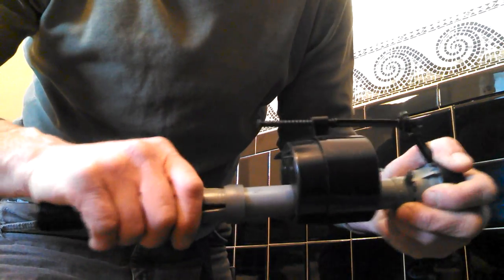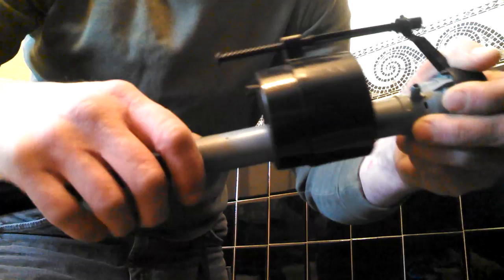Now, this is the fill valve here. It's a 400A. They're pretty decent models. They're also adjustable in their shaft height, and here I'm stretching it out to get the top even with the top of the tank. If it's too high, the lid won't close. If it's too low, it doesn't fill up all the way. And then there's that locking ring I just pointed to.